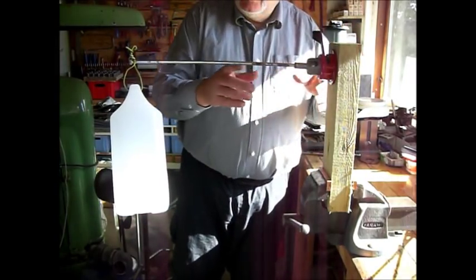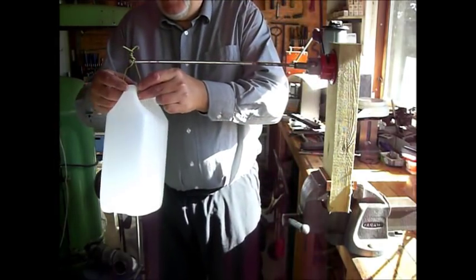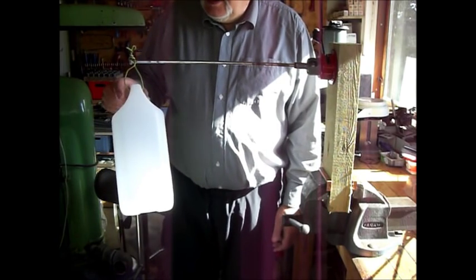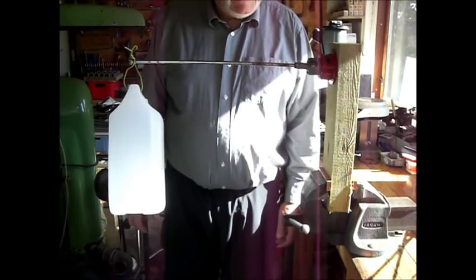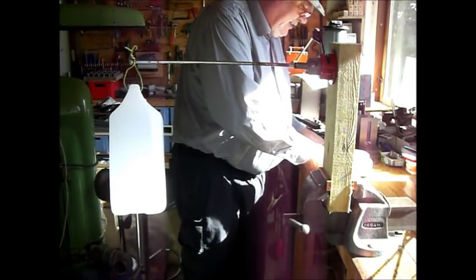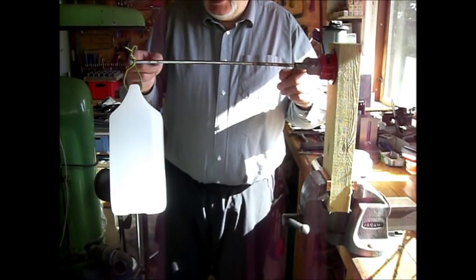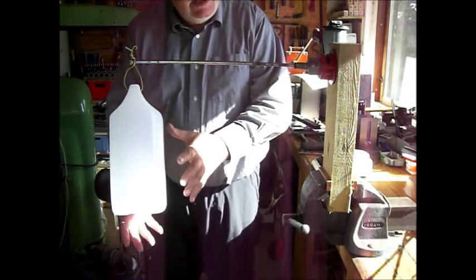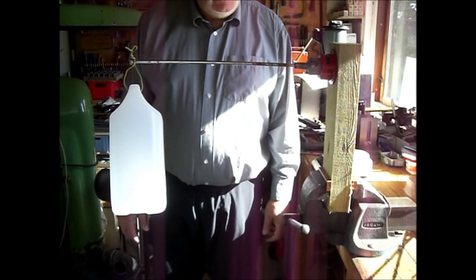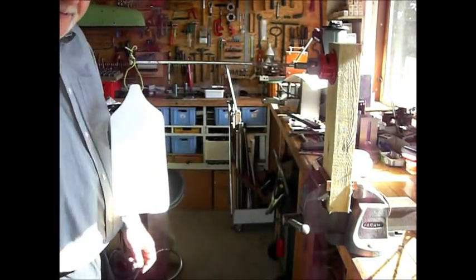I have a little difficulty for you to see all this on this background, but here it is. I have mounted a rod here and a bottle here, and I'll put some water in. When the rod is falling down, I'll take a measurement on how much water is in the bottle - how much it weighs. Then I have to measure from here out there, and this times the weight times gravity should give the clamping force in Newton. I'll fetch some water and we'll see what happens.